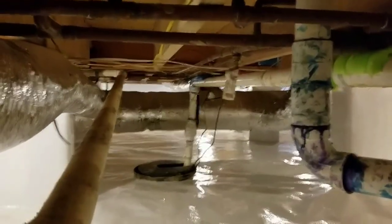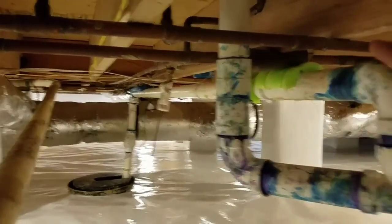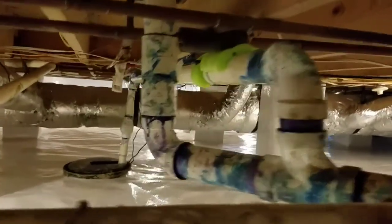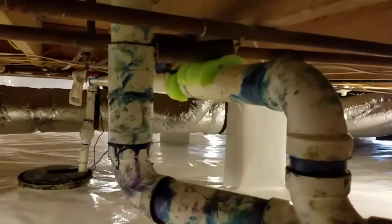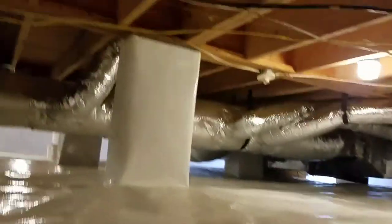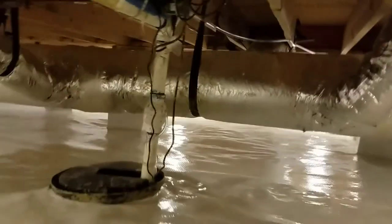We've been doing this straight since 2008, and if it didn't work, old Tanner Flowers wouldn't be doing it. The sump pump over there in that basin — notice it comes up with a check valve right there, elbows over, and ties right into the drain line going outside the home. I put some swimming pool noodles up there as an extra precautionary measure against discharge noise.